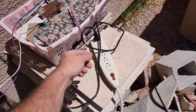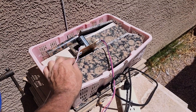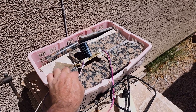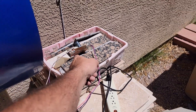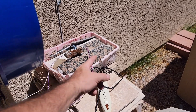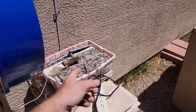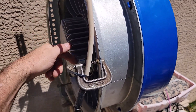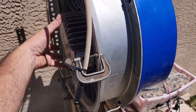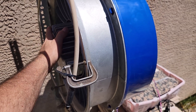I have this going through my step-up voltage doubler circuit, so it rectifies through one diode and charges your capacitor on one half sine wave. The other half basically puts the charged voltage of that with the other half of the sine wave to jump into the secondary capacitors, which is what's in here. So this 208-230 volt AC charges up its DC bank, its bus, its capacitor — two 330 volts DC in there off the 120 volt AC input.